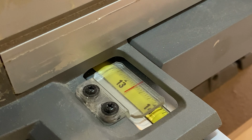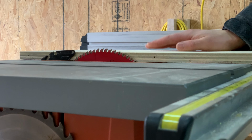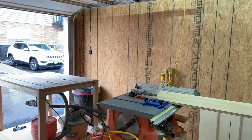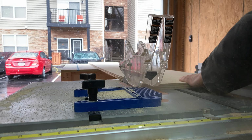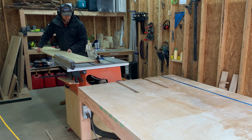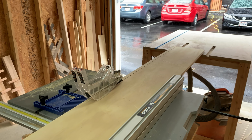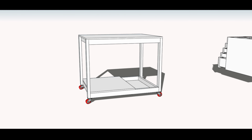This is when I brought a lot of the pieces down to their final size, as I can really dial in the precision on the table saw faster than I can with the circular saw. If you're cutting large sheets like this alone, make sure to use a feather board to help keep that piece against the fence. And now I don't think watching me cut a million pieces of plywood is actually helpful to anyone, since there's a free cut list provided with this project, so let me show you an animation of what we're actually going to be doing here.